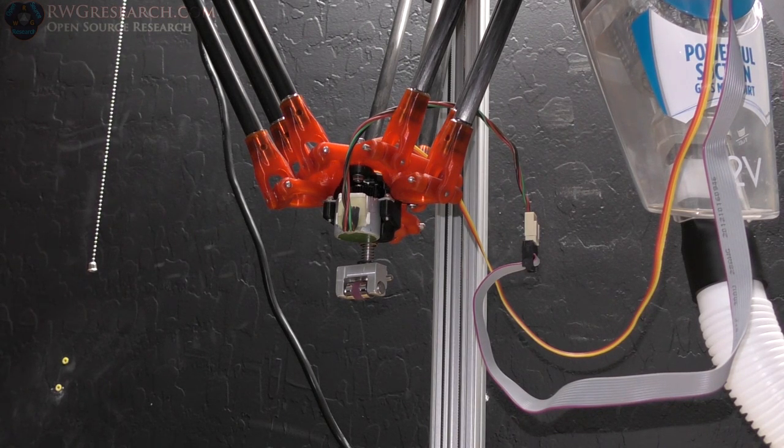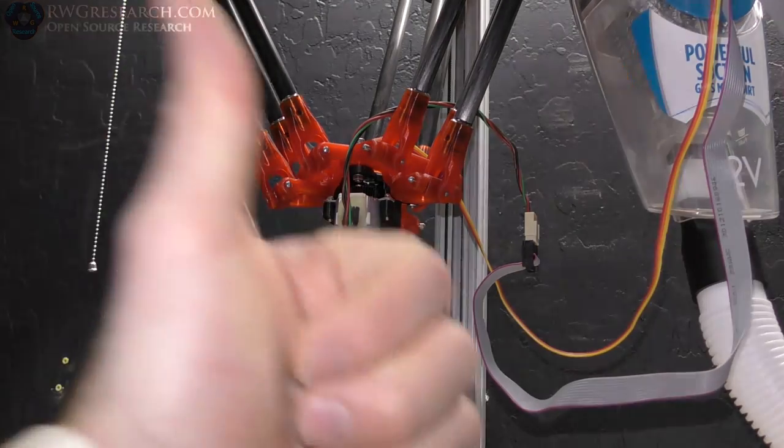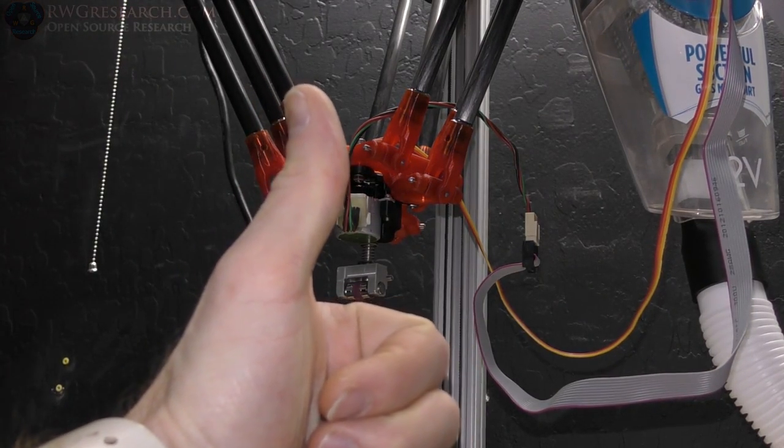So what'll happen is the absolute positioning, apparently the controller rounds the numbers a little bit if they're really big, like long decimal numbers after the decimal point, floating numbers. And that's going to cause an issue because after a couple hundred rotations, it might be off a half a degree. And so you'd have to theoretically home it or unwind it so that it's keeping its absolute positioning. So these are some things that we're going to have to figure out. But ultimately, proof of concept is success.